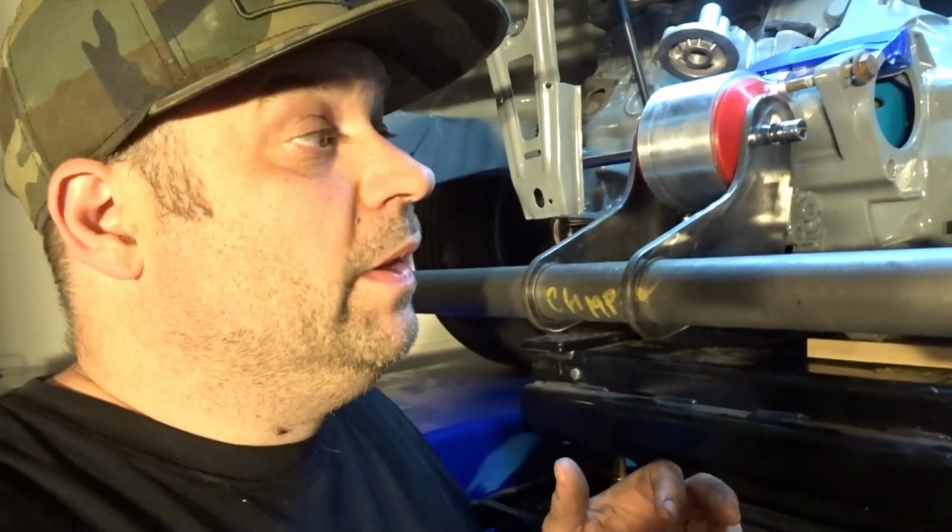With the hybrid bushings, it is better than stock, but you still get the wheel hop once you start upping your horsepower. On my car, I started noticing it once I hit over 280 wheel. This thing should be right around just under 400 wheel horsepower when it's done, with projected boost and what this is capable of. So this thing is going to have a traction problem, and I'm trying to resolve that as much as possible right now. So let's go over the traction bars.